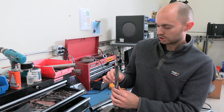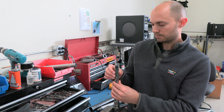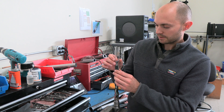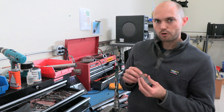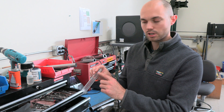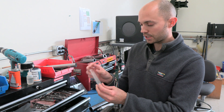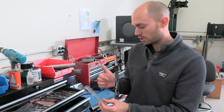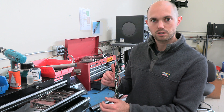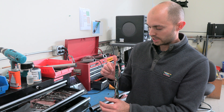The next thing I'm going to do is pull up this plastic tube. Same thing — be very careful not to damage anything. Before I put this in the oven, I'd actually look at this tube and make sure there's no moisture on the inside of it. If this tube looks foggy or you see any condensation, that's a good indication that the cone got wet, which is probably what's causing any connectivity issues or drifting in your channels.